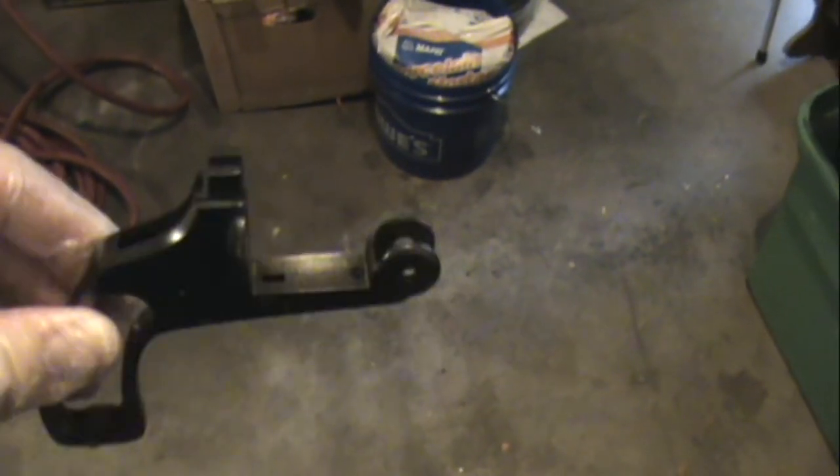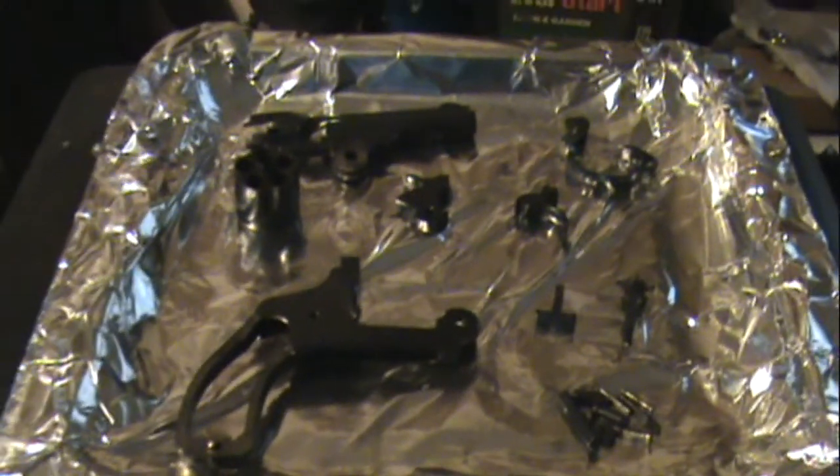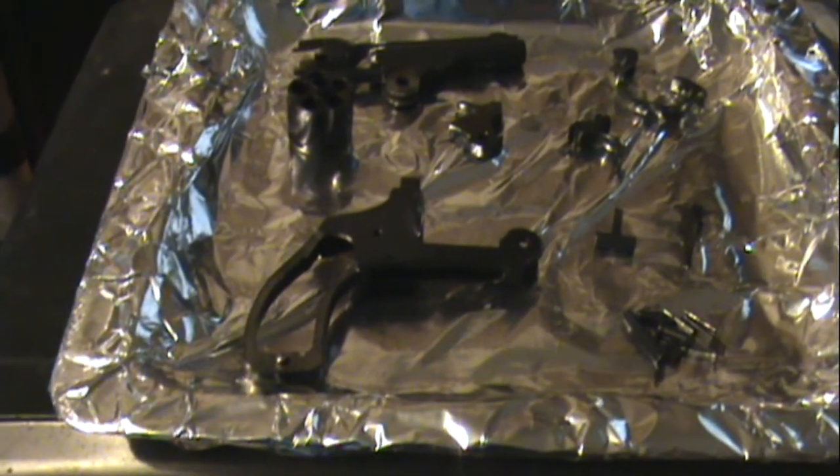This is the tenth session I'm doing with it. I just put it on a pan — you want to make sure you wear gloves. I stripped the nickel off this one, then I went in and soaked these in acetone, got all my parts degreased, and I took them into the kitchen sink with a purple power soap. You can use any kind of commercial grade soap and just a wire brush — soft bristle dish brush — and scrubbed them to make sure they were totally degreased. After that, I never handled them without having gloves on.